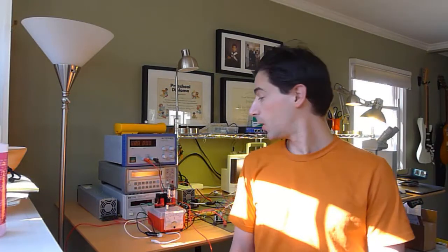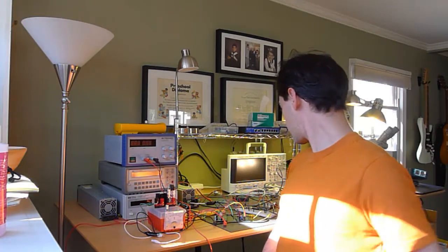And it also has a high 100% override, so if you pull one of the signal pins to 12 volts or higher, it sends the unit to 100% duty cycle all the time. You would use that if you were using aux lights, for example, and you wanted the aux lights to turn up all the way when your high beams were on. You could tap that to your high beams, and then when the high beams are on, the auxiliary lights are on too. So right now I have the device actually running under test.